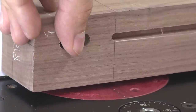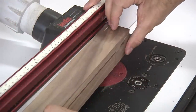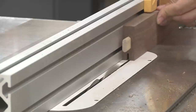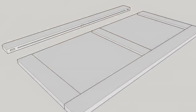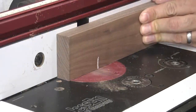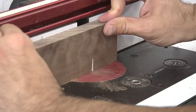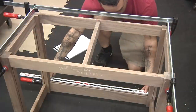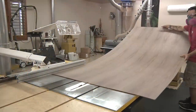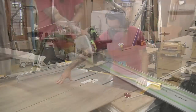The back panel will be made from quarter inch plywood, so let's cut that groove while we're here at the router table since the process is pretty similar. I'll use a quarter inch bit that's made specifically for undersized plywood. Only the rear legs receive this groove. The top and bottom back rails also need a groove for the plywood back, so you can use the router table or consider making two passes at the table saw. The grooves for the lid are very similar to what we did for the back panel, so we may as well cut those now too. Keep in mind the long rails have two start and stop points because of that center divider.